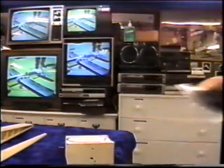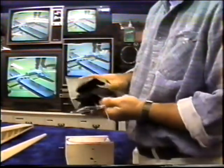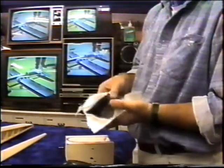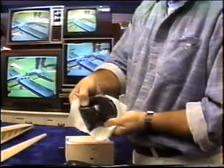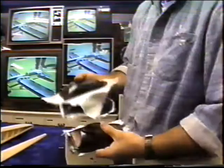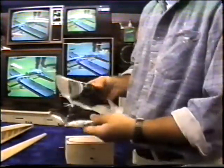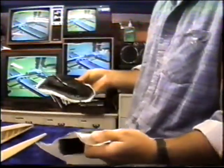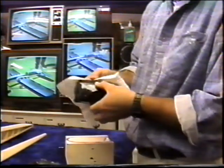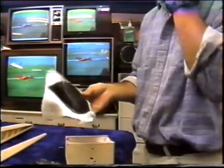I got three of these suckers now to play with, and that's the whole idea here: once you can start getting these to pop out of the mold, now you can make one with lighter cloth, heavier cloth, more resin, less resin. Now when I make the next one up, again I got an air pocket up here, I'll take care of that, then all this can dry and I'll set up the belt sander and the Dremel tool and make three or four or five of these cowlings up all at once. But this way I have one with three layers of cloth, two layers of cloth, and one layer of cloth, and then I can evaluate: is that stiff enough, not stiff enough, do I need a little carbon in there? I have a lot of choices here.